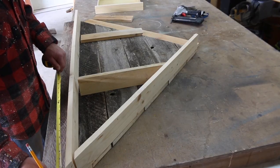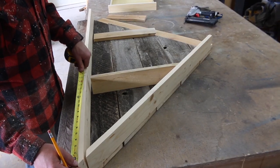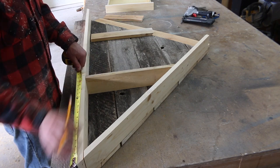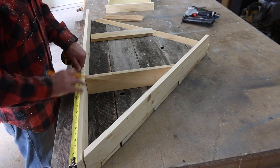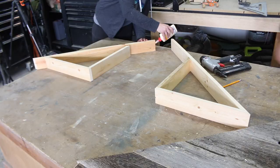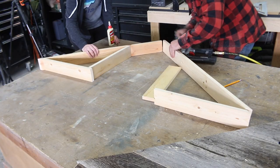So I decided to test it out to see how it looked. I determined I could make the drawer a bit larger than that one and that the outside dimensions of the drawer for this project could be 17 inches in width by 16 inches in depth if I had an 18 inch wide opening.